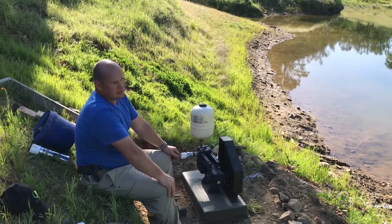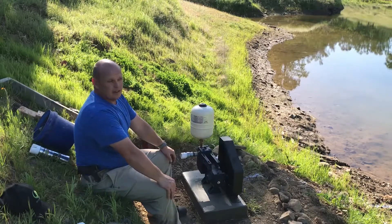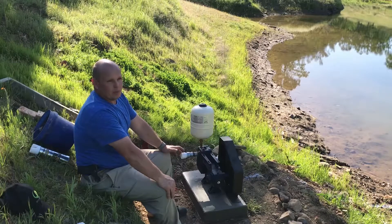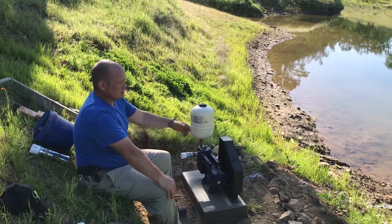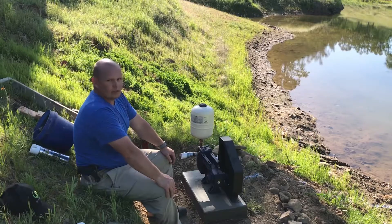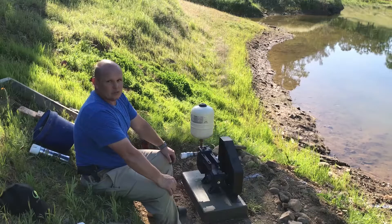This year will really be the testing phase, but I'm excited. Solar pumping — doing 10 gallons a minute off of two solar panels and some batteries — you could just do this PV direct and run it as long as the sun's out, but I want to get more out of it. I could also use this as a pressurization system mainly for irrigation. It's a big experiment, and it's really about learning for getting to the next phase of being a hundred percent sustainable out here off hydro, wind, and solar, and being able to grow enough food to reduce bringing in outside fuel and food.